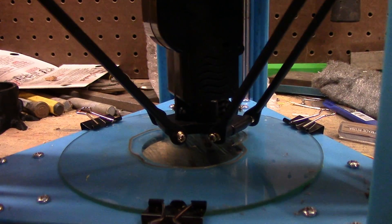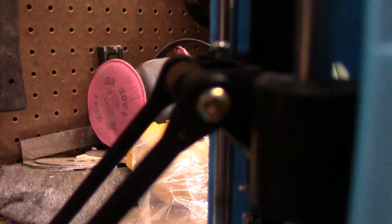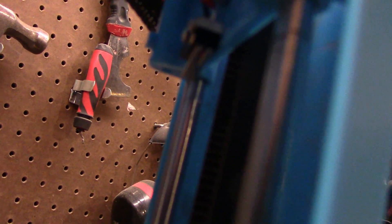That's the quick and dirty. I'm not actually going to adjust anything because I don't really need to. Remember, the actual bed leveling itself is that screw and the switch — it's literally just changing the height of the screw, telling it its absolute or relative position. It tells it the height, adjusts the height of the arm itself, because the motor doesn't know any different.